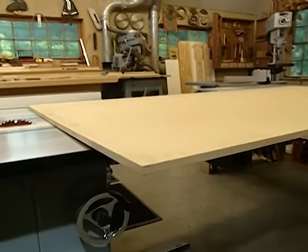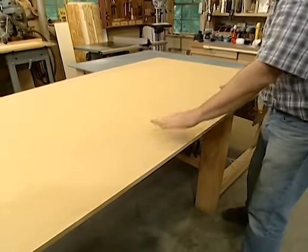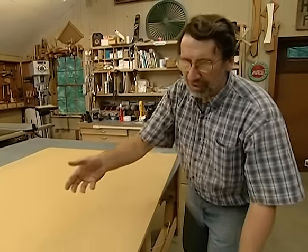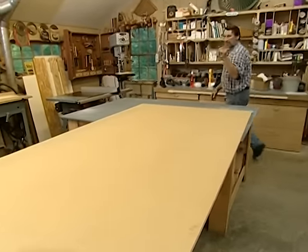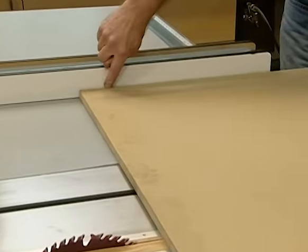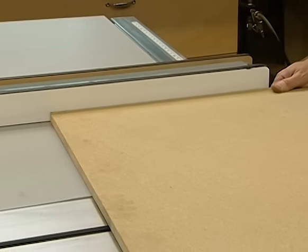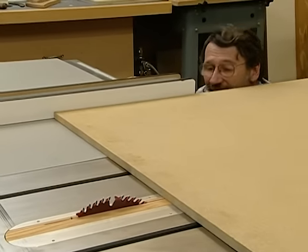Let's talk about working with sheet goods like plywood and particle board. I build a lot of projects using those materials, and I often work alone, so I need a couple of helpers. First, I have this assembly table built at the same elevation as the top of the table saw, so it becomes a nice staging tool. As I handle the sheet, my right hand guides the piece through — pushing and pulling — while my left hand pushes it up against the fence. You might think I'd be looking at the saw blade as I push the piece through, but I'm actually looking right at the fence, making sure the edge of the plywood stays tight against it throughout the whole rip. The blade height should be no more than the thickness of the plywood or just slightly above.